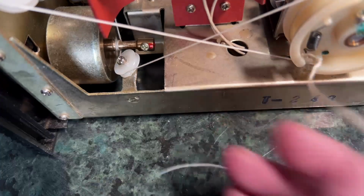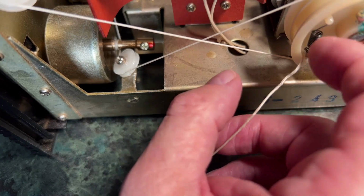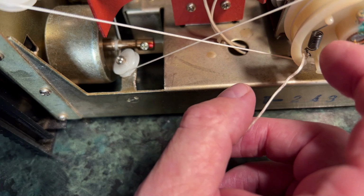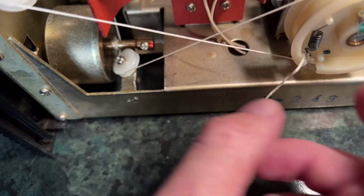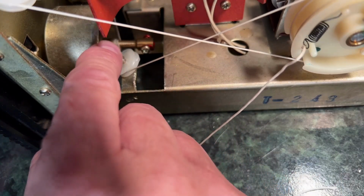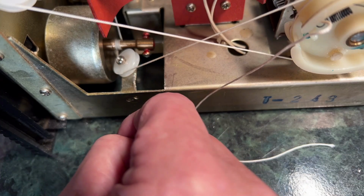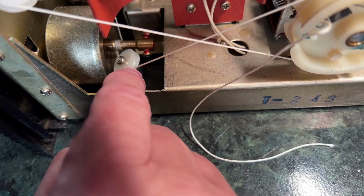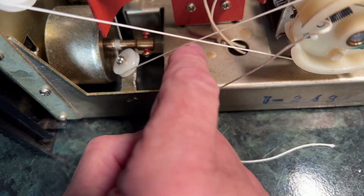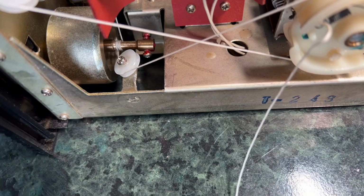Now ignore this loop here, because let's just try and give me a bit of leeway to change the tensioning. This is a really odd system because there's a tensioning spring on this side and there's one that you can't see on the other side as well, and I thought maybe this is a tensioning thing. Getting the tension right on both sides is correct, and I tried tightening it up on both sides, but what that seems to do is, I think it's a bit too tight because it's not spinning correctly as a flywheel should. I know the tuning knob itself is bent. You can't see that in shot, but the flywheel is straight. I've tried moving this around a little bit, but it doesn't seem to be any better with the new cord than it was with the old cord. And I've checked that the cord is the same as the old one. It's 0.6 millimeters. So I'm beginning to run out of ideas of how to fix this.